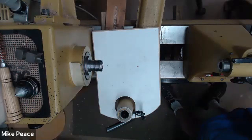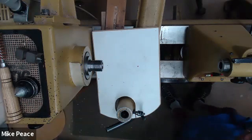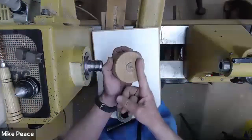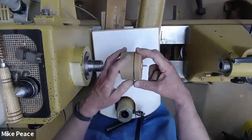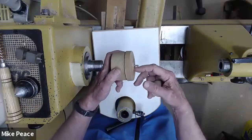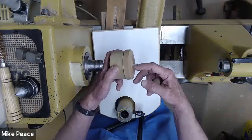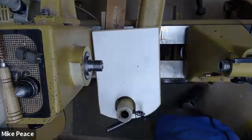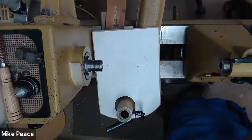The other thing about a screw chuck is that you always want to use tailstock support as long as possible. And the screw generally works better, will hold better, if it's going through side grain. In other words, this block right here, the grain is not running in this direction, because it tends to be a weaker thread. But if you do it this way, it's going to be a stronger thread and hold this screw longer. Screw chucks tend to be specialized, special purpose. Make one for that kind of project where that is the best way to hold something on there.